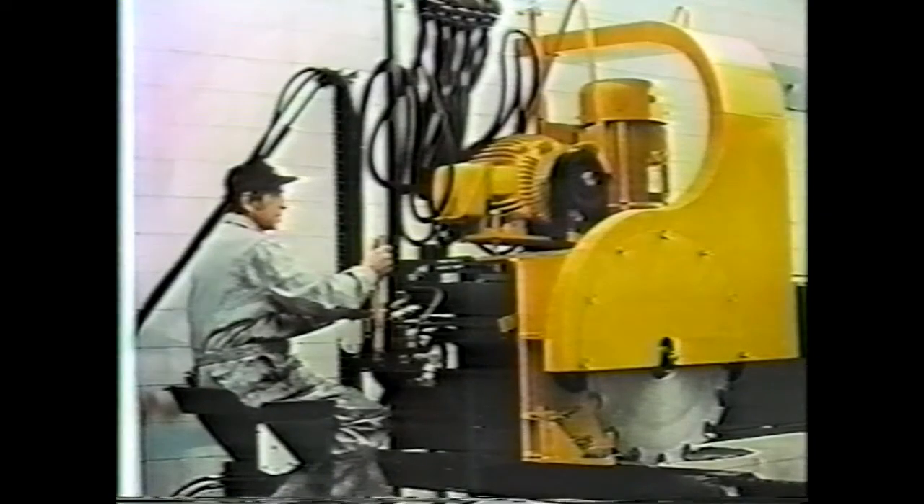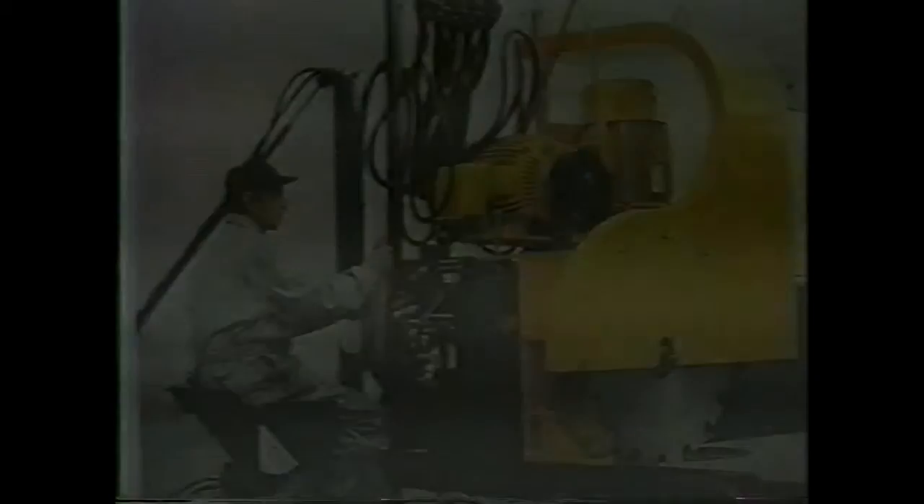The saw is equipped with a 30 inch diameter head saw and a 26 inch diameter edger saw complete with replacement teeth. An option of a third saw is offered if required — a 13 inch diameter edger saw making the saw capable of cutting two 4x4s at one time. Saw blades are standard blades with replacement teeth with a 5/16 inch wide kerf of high quality material, with a minimum but standard amount of tip maintenance providing a long, useful life.